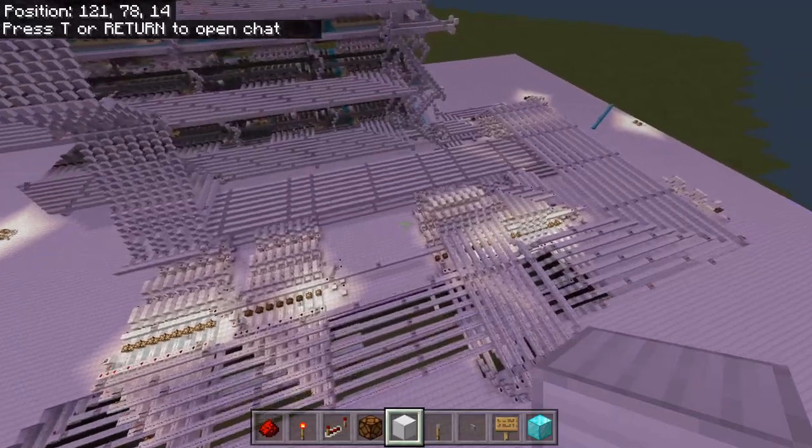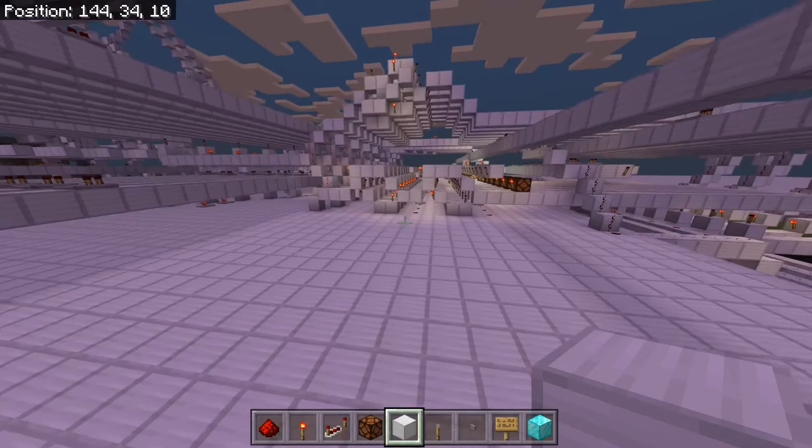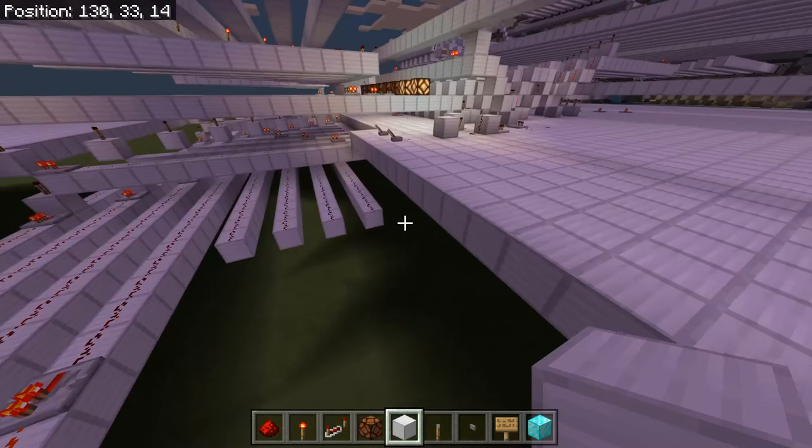Dealing with the opcode register and building the clock and phase control for our processor. So the opcode register can fit in this space here. Previously I thought this space was going to be used for the program counter incrementer, but yesterday we built that directly above the program counter register because that turned out to be really convenient. Today we're going to build this opcode register above over here.